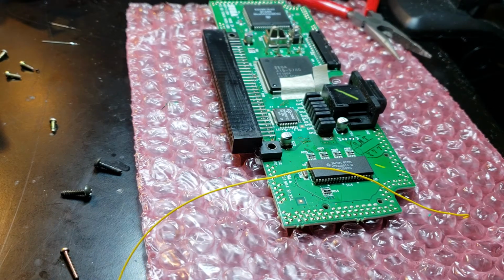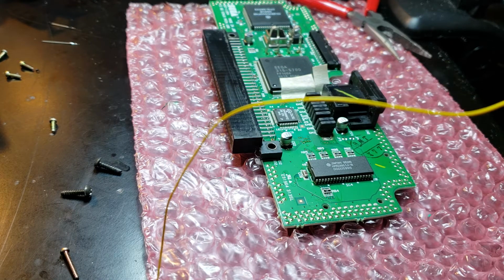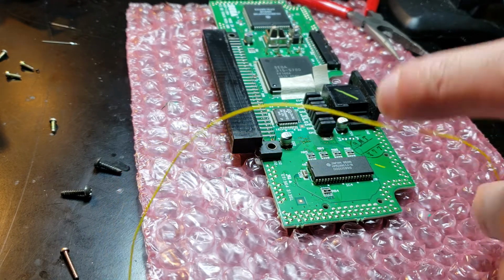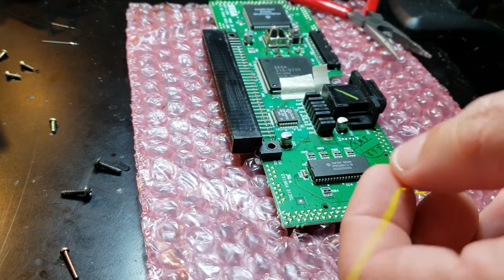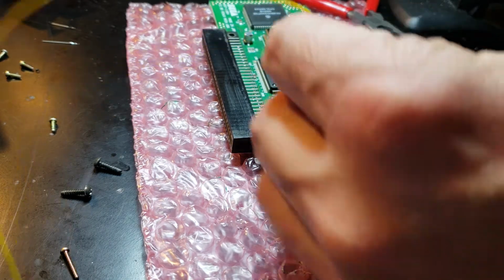A little bit more solder on there. The only problem is it needs just the smallest amount. And we also burned our flux off, so we put a very small amount of that back on here. Thing is, we can't force anything. Alright. Let me try this again.